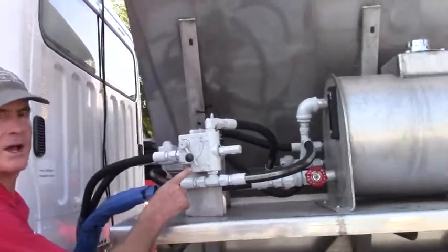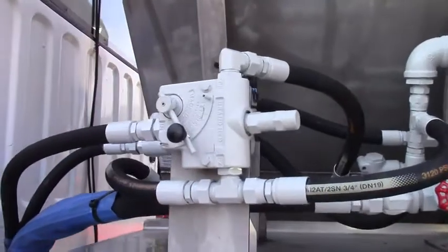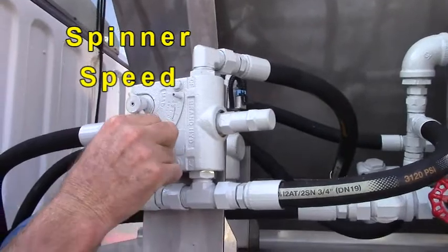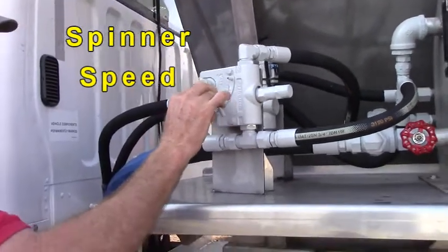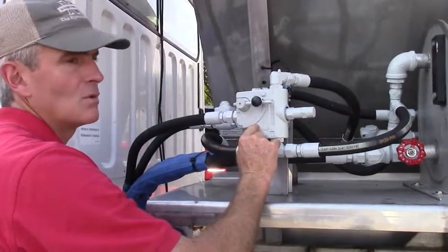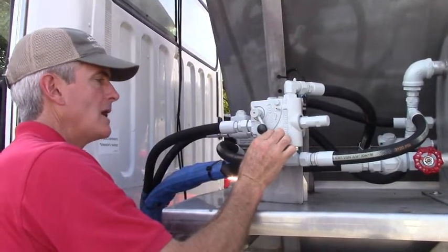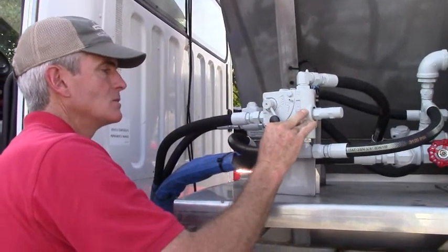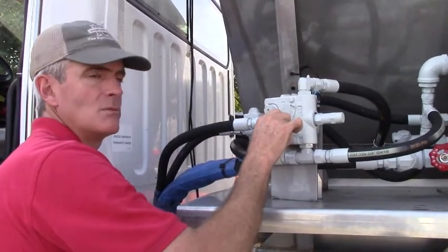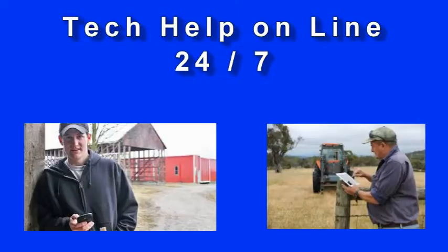This is our flow control valve — it adjusts the amount of hydraulic fluid going to your spinners in the back. This is a manual spinner speed control. If you wanted your spinners to just stop, you would go all the way to zero. Always remember where you had it, or put an ink mark there, so you can go back to the same spot. Once you get your spread pattern correct at a certain RPM of your spinners, you want to make sure you maintain that RPM.